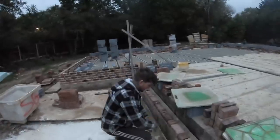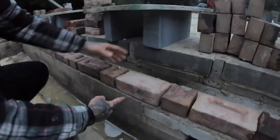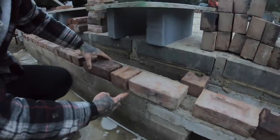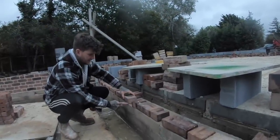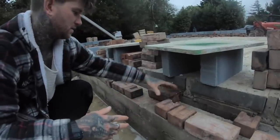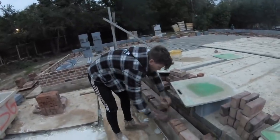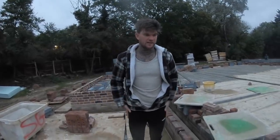So let's say my bond was here. Let's say the window was there. I would really ideally want to take that half out, put that there, move that over, and usually if the window size is brickwork, I'd have to move this brick here and this brick here, then I would come to the center of the window and make the broken bond, which would probably be, I don't know, well, that don't work, but that was a bad demonstration. But you've got to figure it out. It might even be double header, tighten them up, 3/4 or something like that. But it does take a little bit of working out.